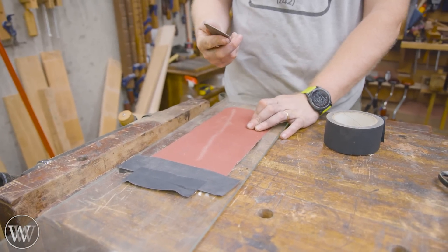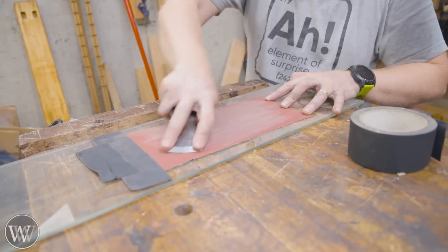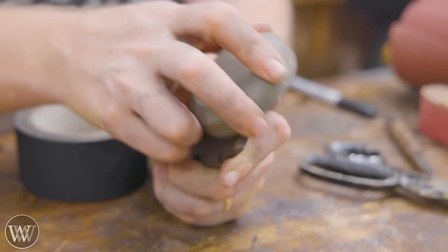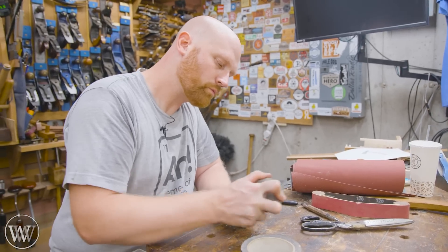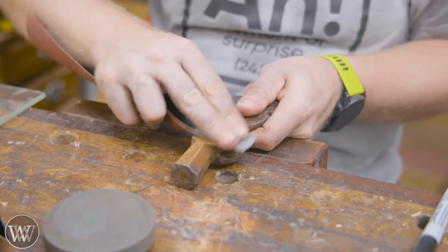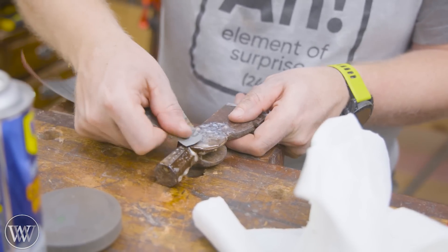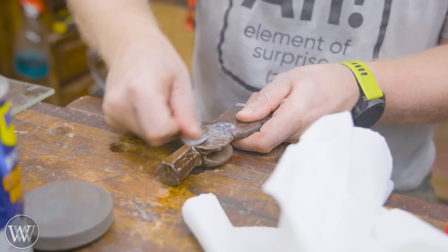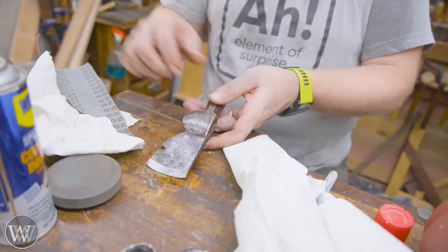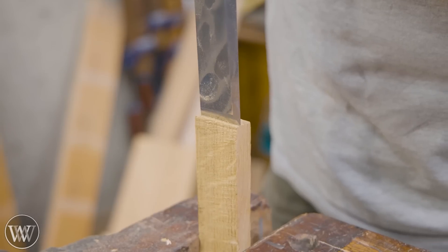For sharpening the iron, this thing needs a lot of work — it was beat up as a kid's toy. I'm not going to take it crazy sharp because it will still be a kid's toy, but I want it sharp enough to sink into some wood and have fun. We're going to grind it with coarse grit sandpaper. I do that for almost all my grinding — I find it faster and more efficient than a bench grinder. Just putting sandpaper on glass around 30 or 50 grit can do amazing work; that's also how I do most of my plane sole flattening. I'm using some WD-40 Specialist rust protector as a lubricant. I'm only using around 150 grit and I'm just hitting the high spots to smooth it out and leave just a little bit of patina in there.